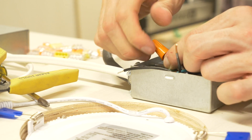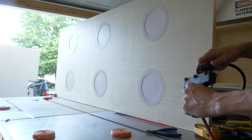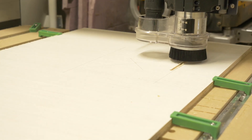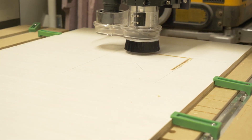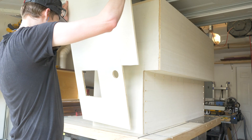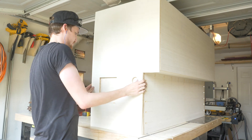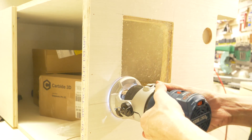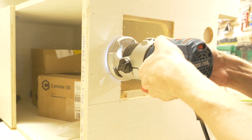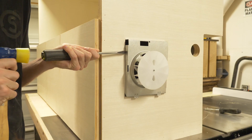The backside of this panel is where I house all my electronics. Once I made sure everything was working, I was good to put the top panel on. I had to make one side of the enclosure double thick with plywood. I made a panel and cut the recesses that I needed on the CNC, and then used that as a template to flush trim the rest of the side after rough cutting it to size.